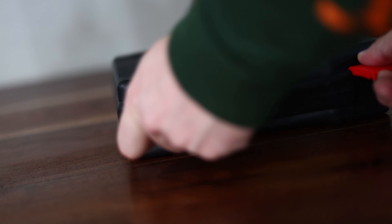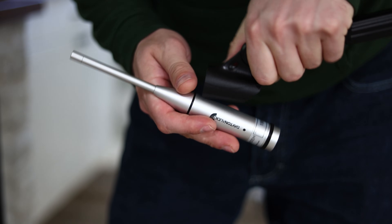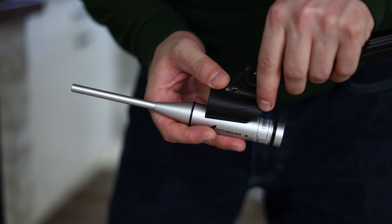You're probably thinking that's it — frequency response and impedance are the same, therefore the speakers should sound exactly the same. But we're not quite done just yet. Let's do one more test you might be unfamiliar with, using the OmniMic again: it's called a bass decay test. Basically, we're trying to find out whether the bass decays at the same rate in each enclosure.